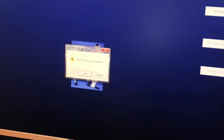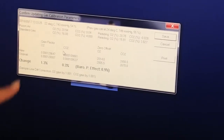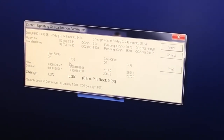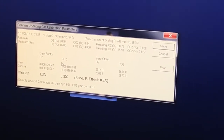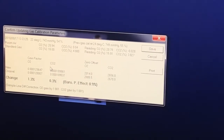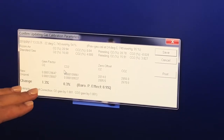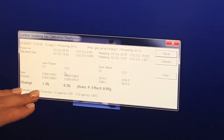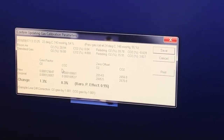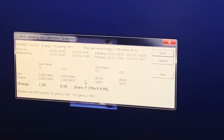Turn it off and click OK. The reading is 1.3 and 0.3 — we want them all to be less than 1%. Because the barometric pressure was very different from the last calibration, I'm going to click OK and do it again. It compares to the old reading, so it doesn't mean anything is wrong — it's just very different from before. I'll click Save and try again to see if we get something very similar.